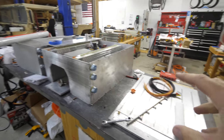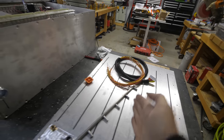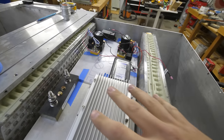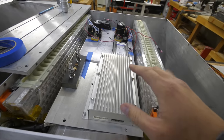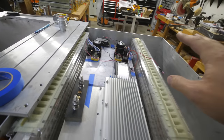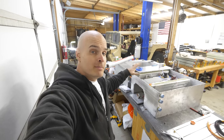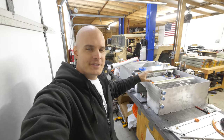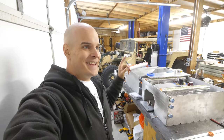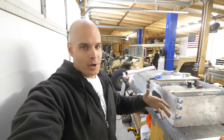To summarize: we built these boxes that are modular. This is the bottom plate that the Tesla modules fit into. These are the high voltage components that allow everything to run. We have a BMS that monitors the voltage and temperatures, and contactors that allow the electricity to flow from the batteries to the electric motor. Right now we just have them placed tentatively so we can get the 180 connections from the BMS wired into the modules.